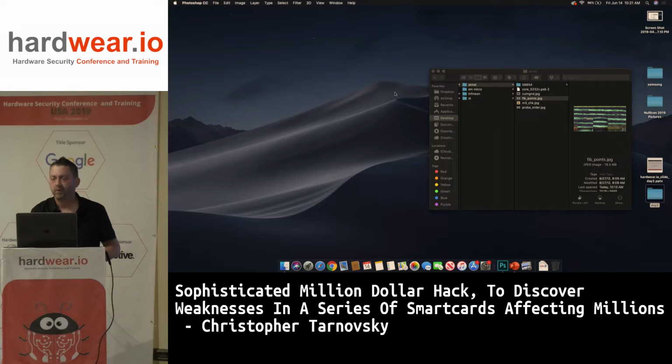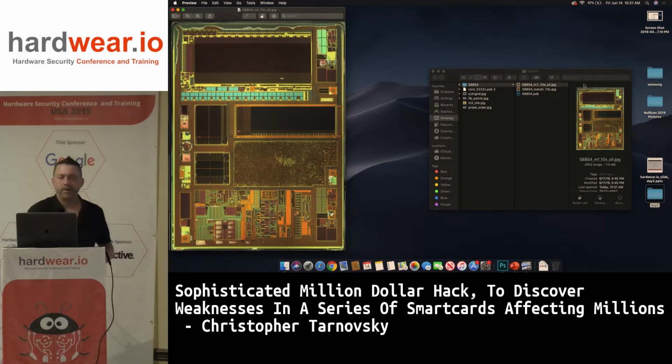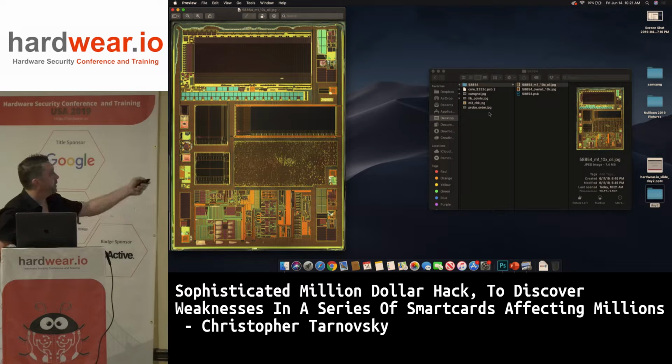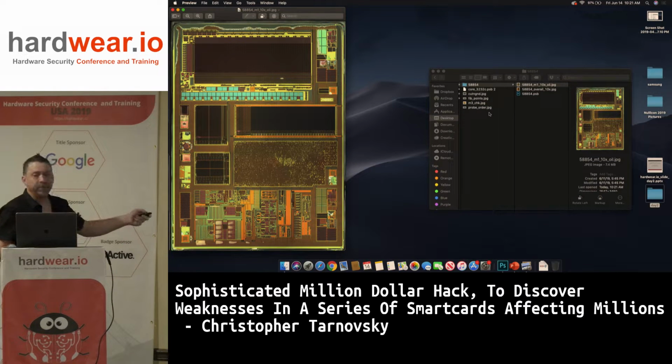How much? 20? Okay. Atmel came out with some newer stuff. Here's a newer AVR. So these are all Atmel AVRs. Here they've got a little bit of EEPROM, some static RAM, more static RAM, and a ROM. The ROM was a mask ROM, so Chris Gerlinski could have thrown it into his program and tried to get an output from it. But it's heavily encrypted.